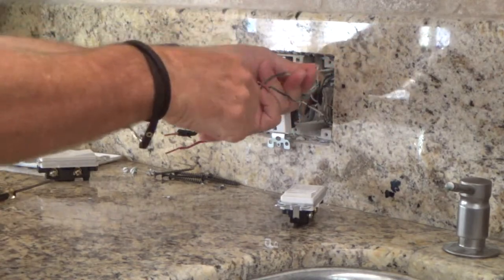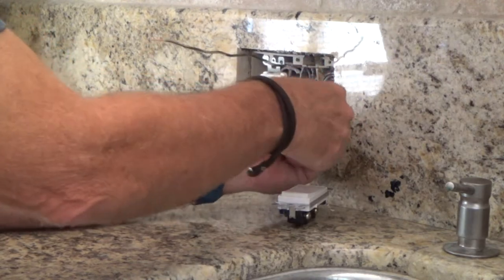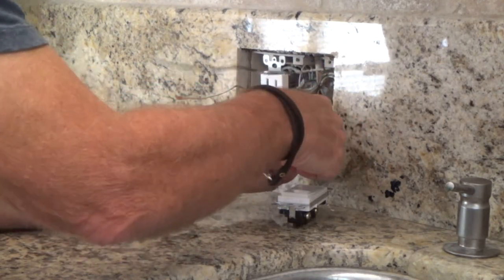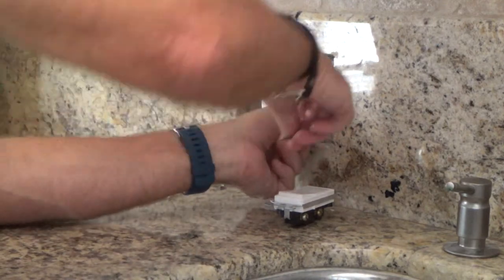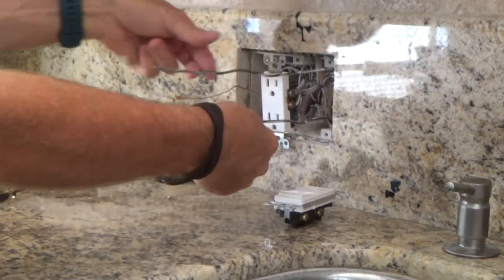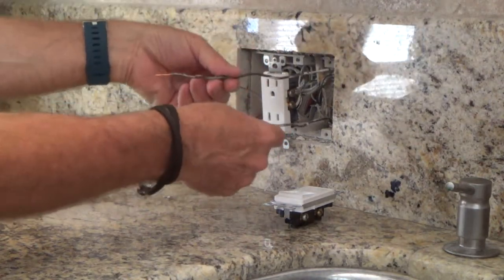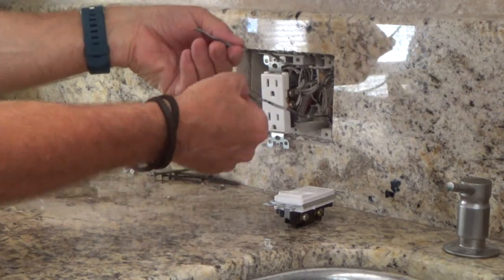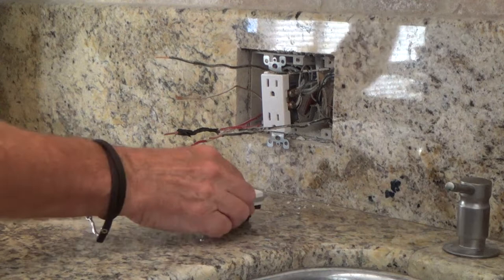See how long that wire is now. This wire comes out of where this wire nut is, so I've got a black wire underneath it. I can pull that out straight and that gave me extra right there — just as much as that. Now, when you re-hook up your white light switch, does the top one have to go to the top and bottom to the bottom? No, it doesn't — it doesn't matter for this particular application.